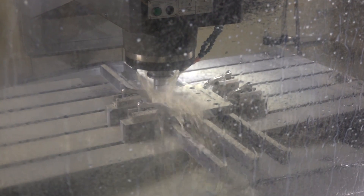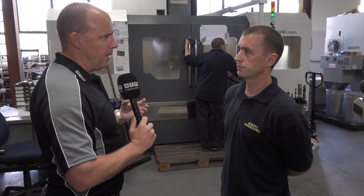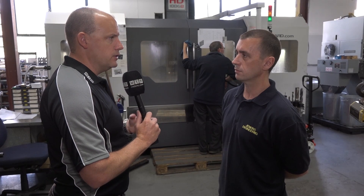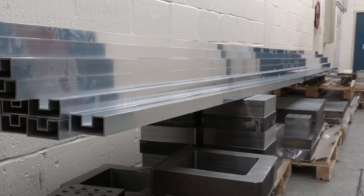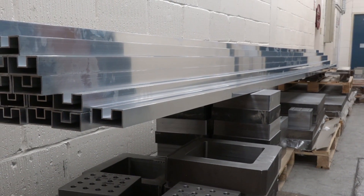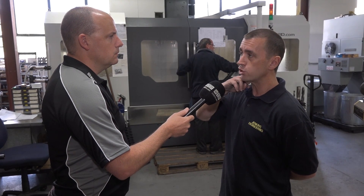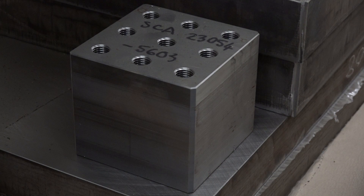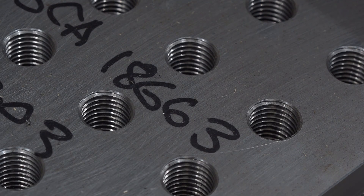You know, when we're milling out big pockets, you can hardly hear it — it's perfect. The sorts of work you're doing there, it's plate work, U-drilling operations, milling pockets — what sort of materials and what are the parts? 90% of it is low carbon steel, just normal mild steel. Occasionally we do some stainless on there, but not particularly often. One of the big differences we've seen is in our thread milling, because we're thread milling our M42 holes, which we used to eat tips on because of the rigidity of the machine. I think we're getting probably double our tool life out of those.